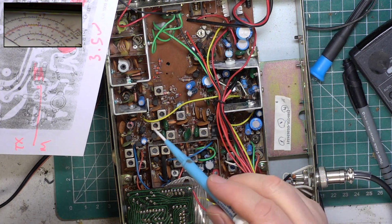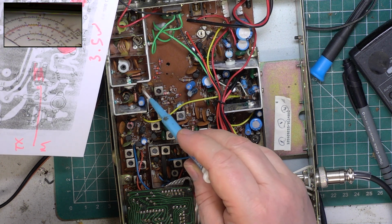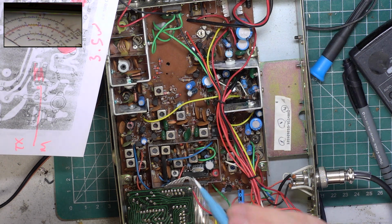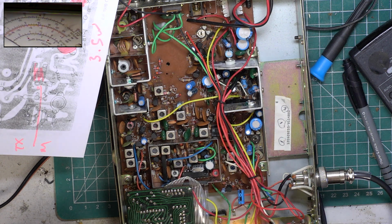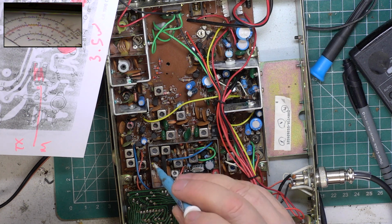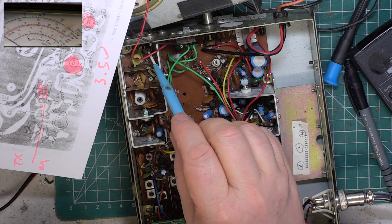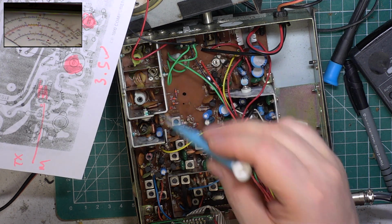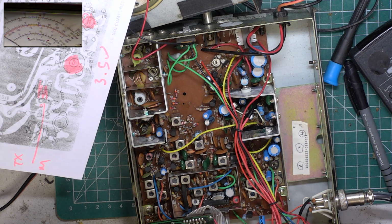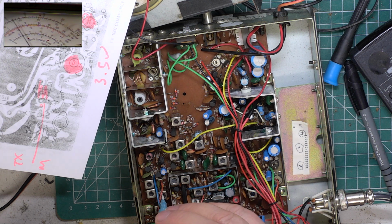Now that said, if these radios are doing really, really low power, it's that resistor there that has got, if you've got a high SWR, this resistor seems to take the brunt of it. So avoiding these, as done with the VTVM, vacuum tube voltmeter or FET voltmeter, we'll now move on to the lineup. And the other one to avoid needs setting up with a spectrum analyzer. So when you see me going down these and missing that, I haven't. It's not part of the transmit lineup. If, of course, it's had finger trouble, then you need to put a spectrum analyzer on it. So here goes.